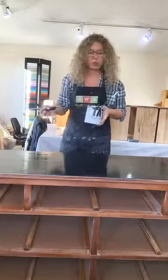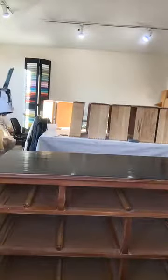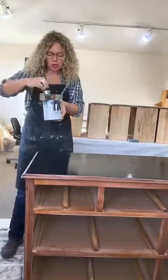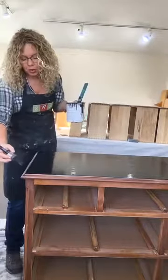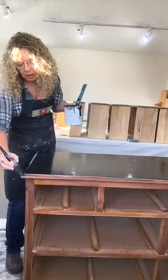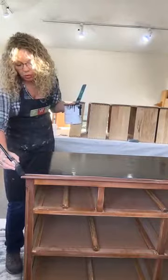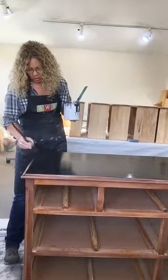Nice and long. I'm going to slide the dresser down a bit to see the edge. So when I'm doing the edge, I want to scrape my brush off on the edge of the can. I don't want to get my brush into the paint on the top that I've already done — it's almost like cutting in. I'm going to go along and pull the brush along. The edge looks like that.